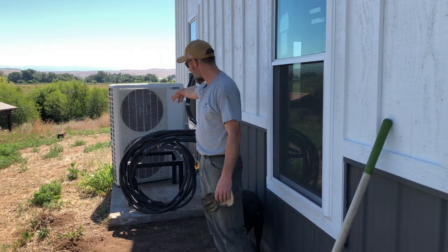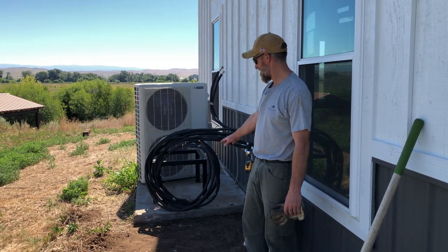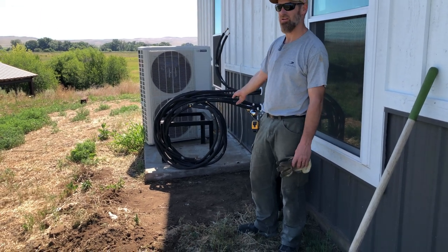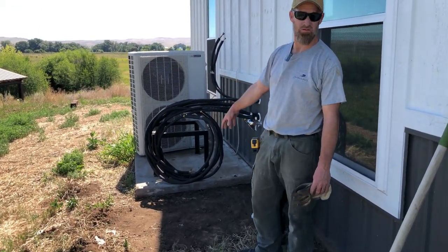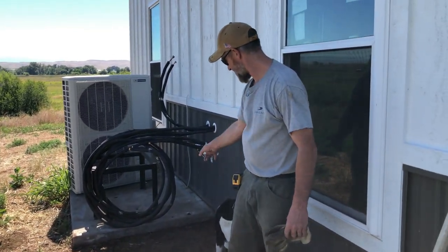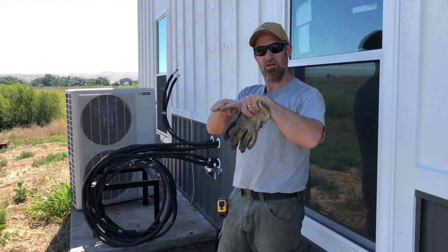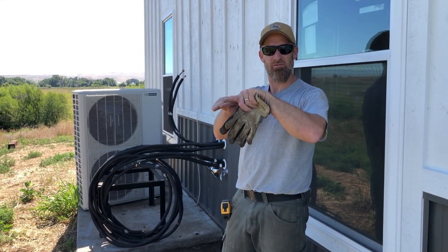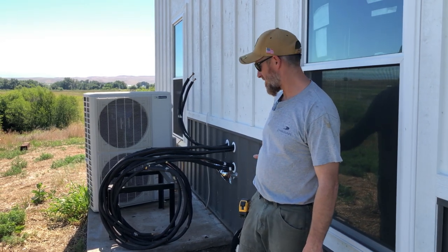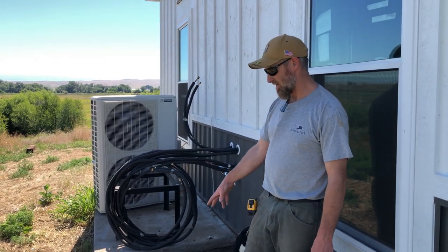We have the stand for that one that I built, and then I've got to build another stand over here, but we're gonna prep this area right here and pour another extension onto that pad. And so the first thing we gotta do, I grubbed this area, flattened it out, but we wanna dowel into that slab and we wanna dowel into the foundation wall so that if there's any settling at all, our pads don't settle at different rates, and we have a step right there, and we don't want it to slide down in the back. We want to maintain a slope so any moisture runs away from the building. So that's what we're doing here.